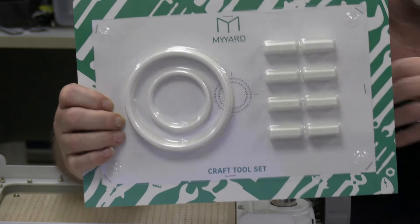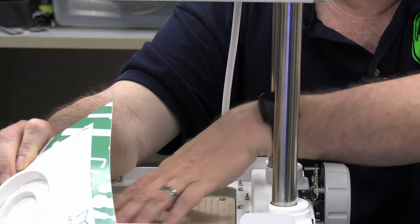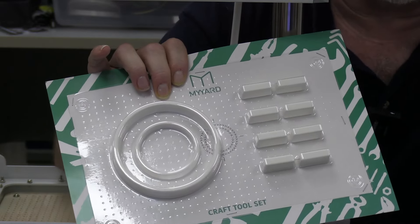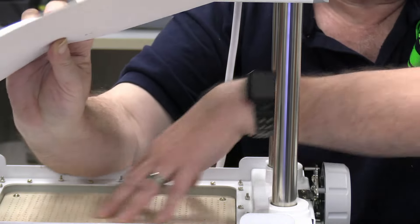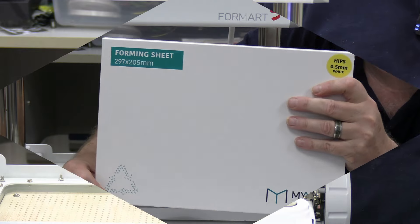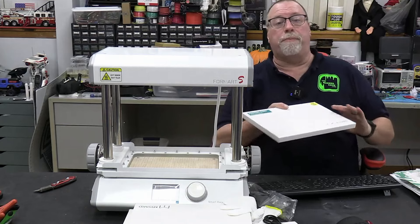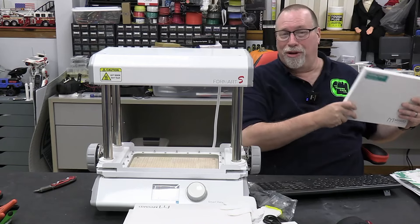One of the things is when you vacuum form and do your pull in here, you can sometimes get rafting or creases in your mold because it doesn't suck all the air down. One way to address that is to put a round or square thin frame around the item before you turn on the vacuum — it forces the plastic to really conform around the object so you don't get those rafts. HIPS stands for high-impact polystyrene — it's an impact-resistant plastic, so it's a little bit stronger than some of the other sheets.